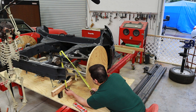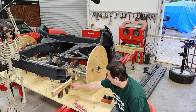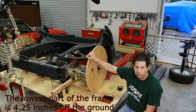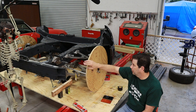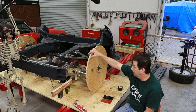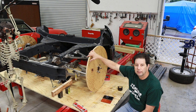According to the tape measure, we need a 19-inch drop between the lowest point of our frame here and the upper frame rail where the suspension mounts are going to actually bolt to. I'm eyeballing it, but it doesn't have to be perfect — these bolt points haven't actually been put on any of the metal yet, and there's plenty of room to go up or down if needed. So what I'm going to do next is get this drawn up with this 19-inch drop and the 45-degree angle, and get that over to the frame manufacturing company. They'll send me those parts and we can continue on the build from there.